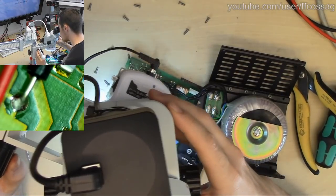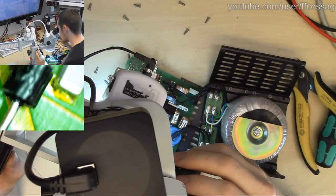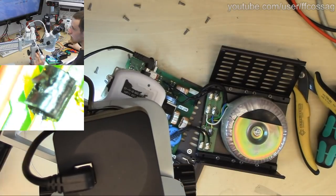What's up with that diode? Is this okay? What is this? What is that? What is going on here? That seems to be just how the plastic's manufactured. Doesn't seem this device has a hole in it. It looks more like a jumper than anything else as well. Doesn't seem to be any semiconductor. I'd wager this is just a ferrite or a pure jumper. And if we measure it, we're going to have continuity across it.